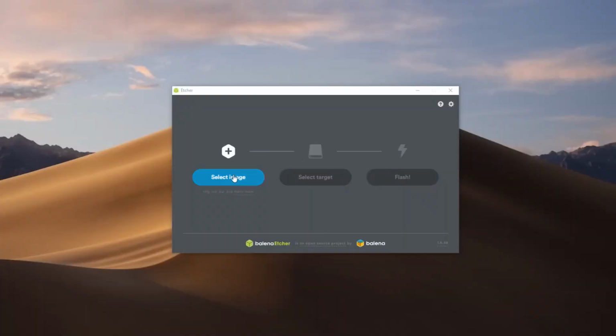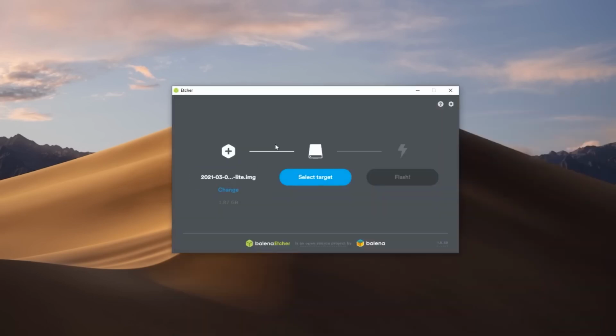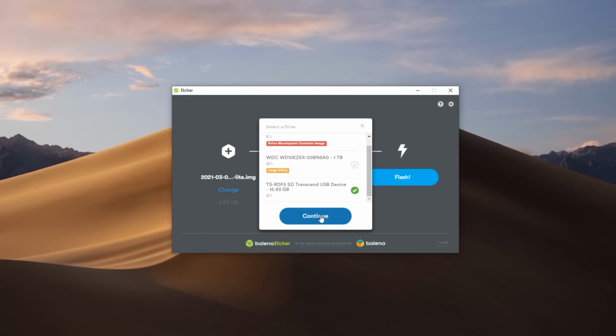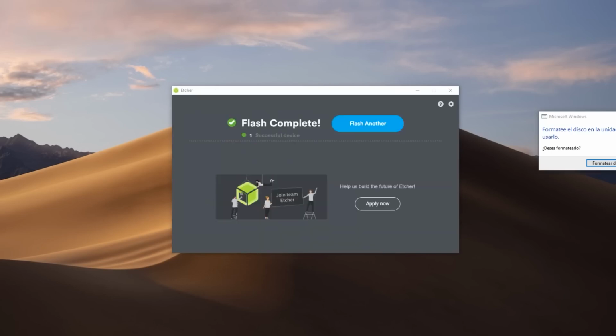Once detected, we download and open the Balena Etcher program. At the same time, we download the operating system from the link I leave in the description, and we unzip it. Returning to the Balena Etcher program, we select the file we just downloaded and then select our microSD card. We wait for it to load, and the software is already loaded.